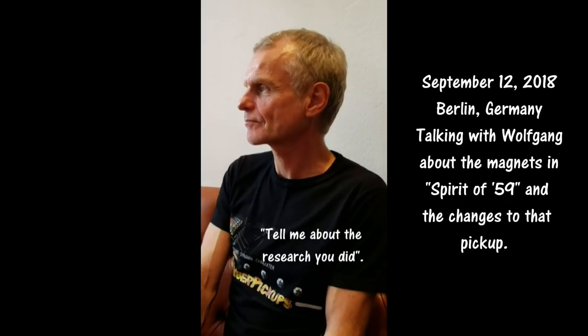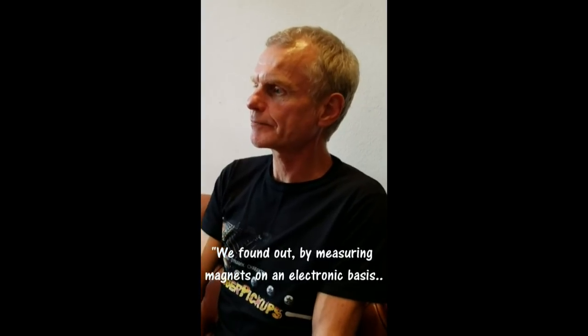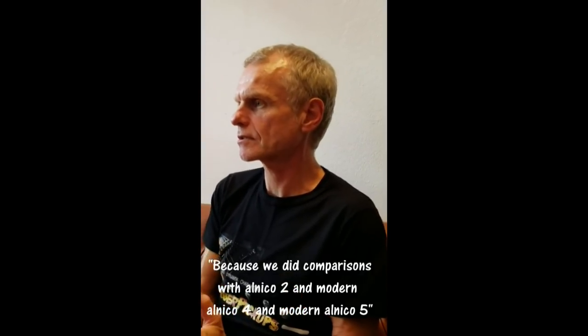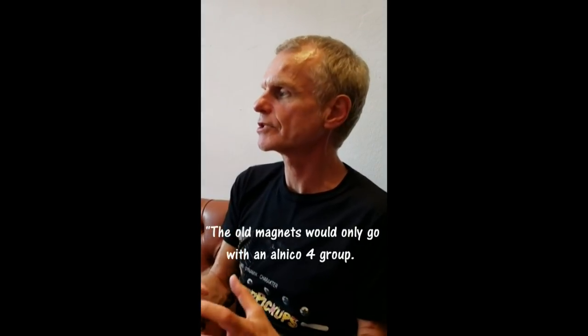So tell me about the magnet. Tell me about the research you did, which by the time the show comes out, the other one will be out anyway. We found out by measuring magnets on an electronic basis that Gibson used, between 1953 and 1960, probably only Alnico 4 magnets, because we did comparisons with an Alnico 2 group and modern Alnico 4 and modern Alnico 5, and the old magnets would only go with an Alnico 4 group.